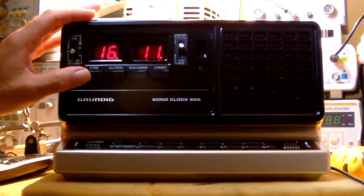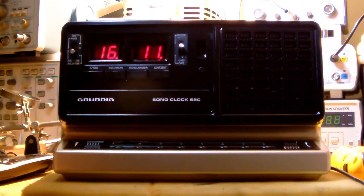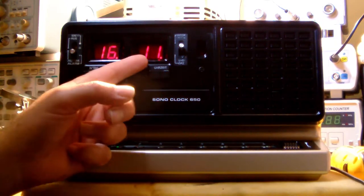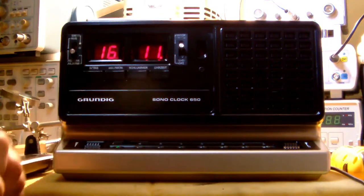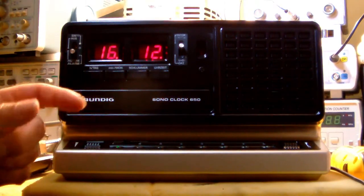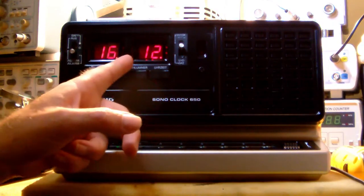a very nice display, which is very easy to look at. You see, the more recent clock chips all use what we call multiplexing, which means that it switches on every single display in turn, very quickly, of course. You can't actually see it with your naked eye that it switches between the digits, but if you would slow it down, you would see it flicker because of the multiplexing. Now, the Fairchild FCM 7010 doesn't do that. It actually continuously drives each and every display element.